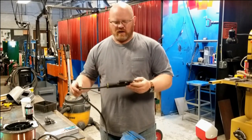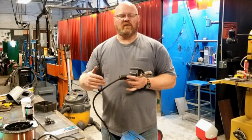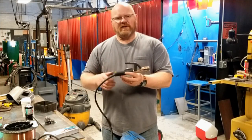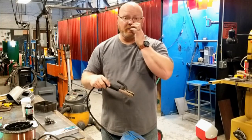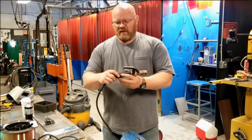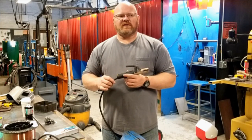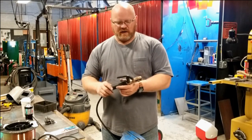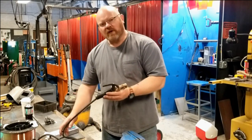But if you're doing repairs of cam locks or lug connectors on number one, number two cable — or two-aught, one-aught or two-aught cable or larger — you generally need a set of high-leverage cable cutters, or a set of bolt cutters will actually work in a pinch, providing the bolt cutters haven't been damaged. For today, I recognize these small cutters won't work on larger diameter cables, but they should work just fine here. I'm going to move the camera down to get a close-up view and get started.